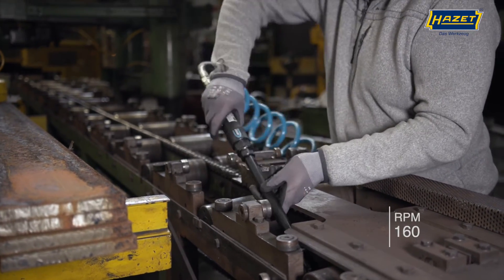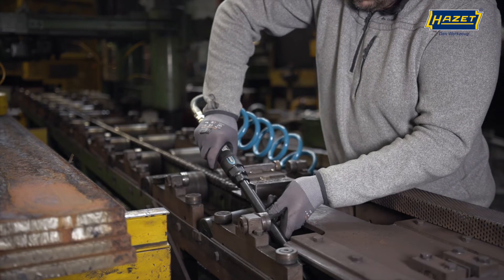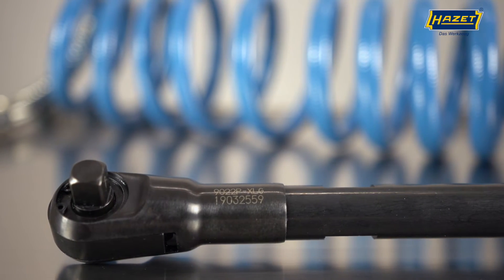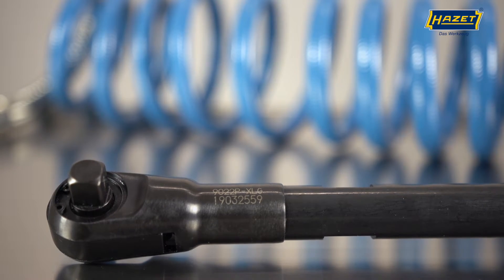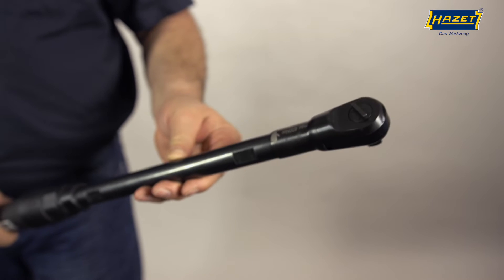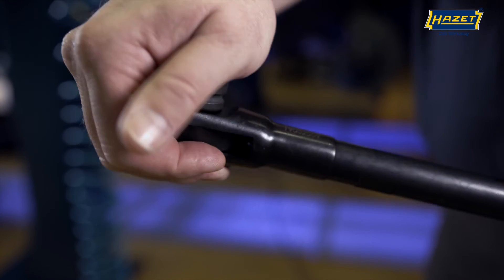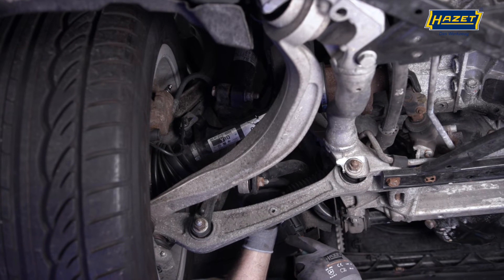When re-tightening manually, torque levels of up to 400Nm are available. The head is only 47mm wide and 54mm long, including the square output. The overall design is extremely slim and long to provide effective bolt tightening and loosening in hard-to-reach areas with very little room for manoeuvre.